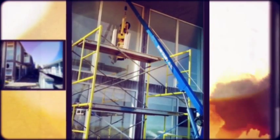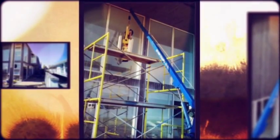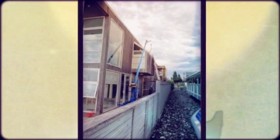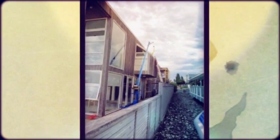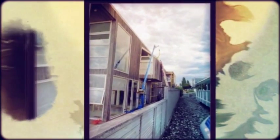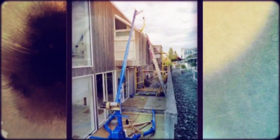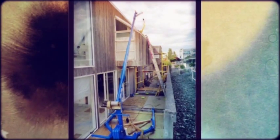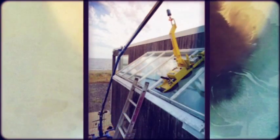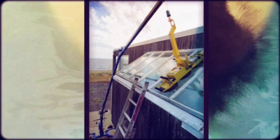Alan said, once I got the panes into position with the crane and suction lifter, I could relax. The crane worked just fine for the upper windows, and for the lower windows, it was great to use the crane just to rotate the glass. The EasyRig crane also worked just fine for the skylights. In the narrow alley on the side of the house, Alan found the EasyRig crane worked great. He used the jib boom attachment to get high enough to position the skylights and upper windows on the side of the house.